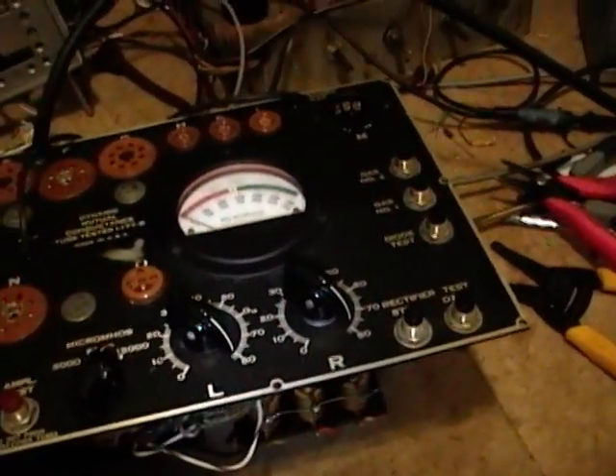This R control is one thing I'm not too wild about — something I'll have to ask about online. This L pot is all encapsulated in a case, but this R pot is wire-wound and just exposed to the elements. It seems odd that something so ruggedized and covered in sealant would have that exposed, but I'll save that for later.